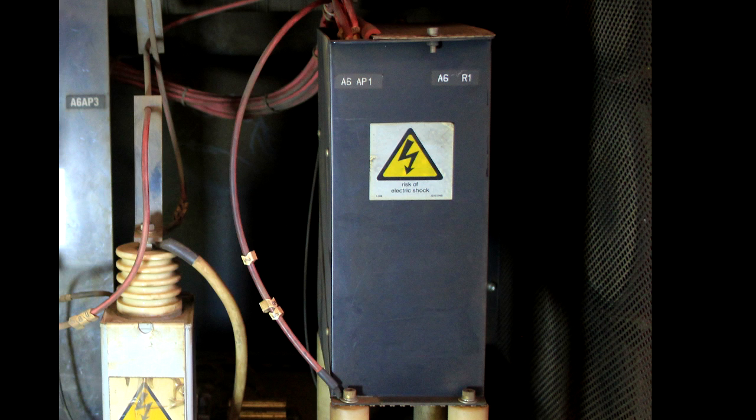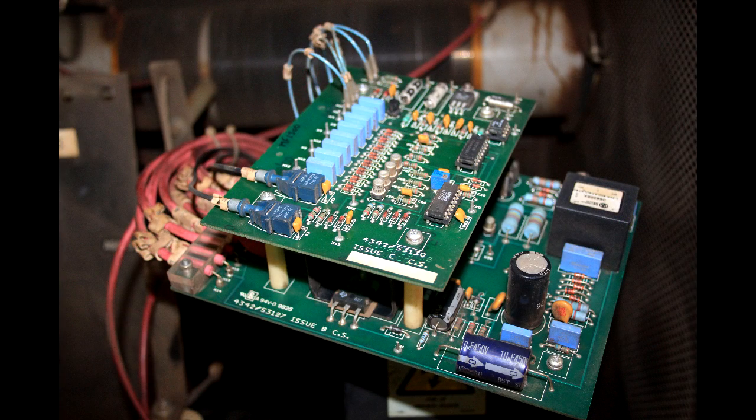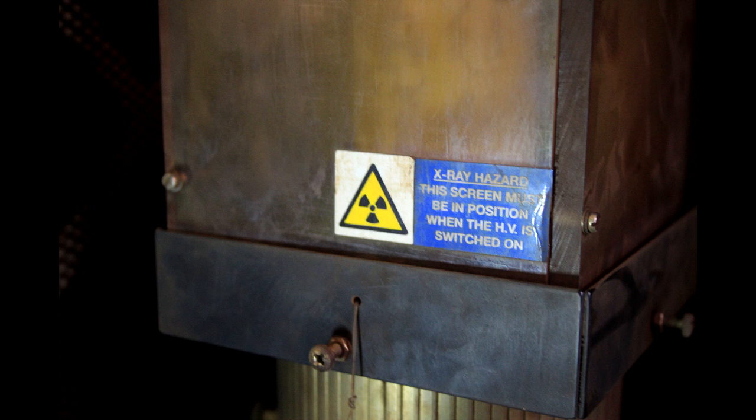There's also an electronic assembly elevated on top of the high-voltage supply, which seems to control the electrodes in the valve. On the left you can see fibre optic cable connectors — these cables run to the control system at the back. This whole assembly is elevated at 28kV, so fairly serious isolation is required. Around the top of the valve there's an x-ray screen that looks like fairly thick acrylic with a slight brown colour from possible additives. Wherever you have high voltage and vacuum there's potential for x-rays, but at 28kV they won't be particularly hard x-rays, so acrylic should block them quite happily.